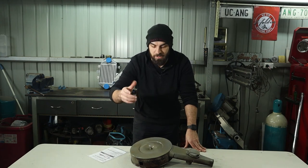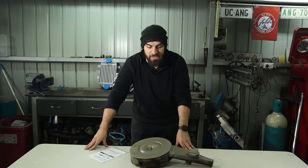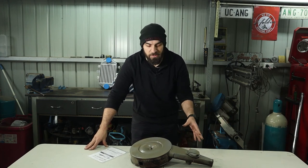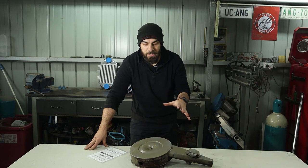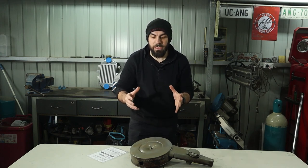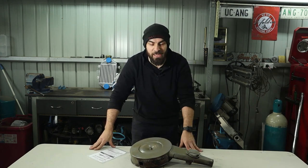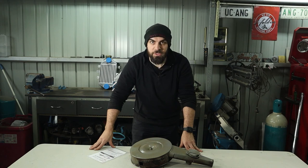I tweaked the valve, and also I turned the tap on a bit harder because I think there wasn't the full amount of water going through the gun, and because it wasn't running close to 15 litres per minute, it probably wasn't causing the venturi, the sucking action of the sand. So once I turned the tap on a little bit harder, it just worked.